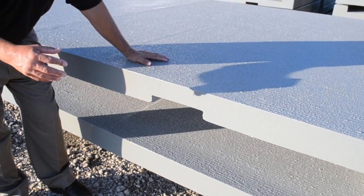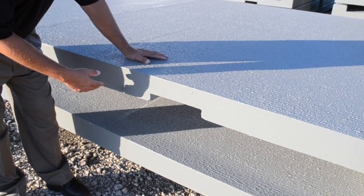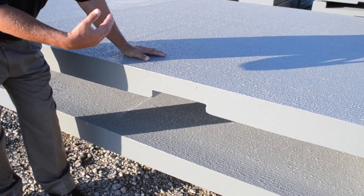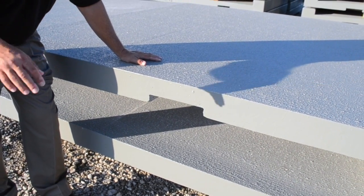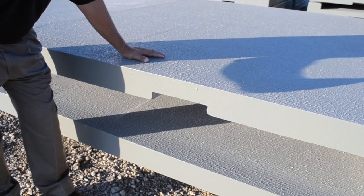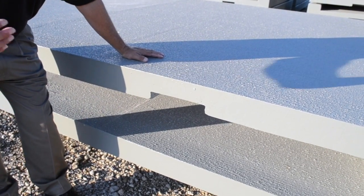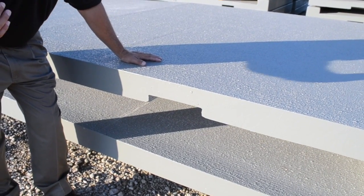In this case here, there is a molded-in instep where the deck panel actually sits above the girder splices. Where the steel girders have to be spliced together, there'll be a top cap and bolts sticking up, and we simply mold a cavity there so there's no interference. The contractor can just set everything on with no need for shims or additional field work.